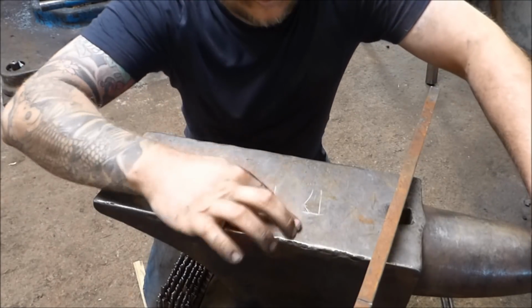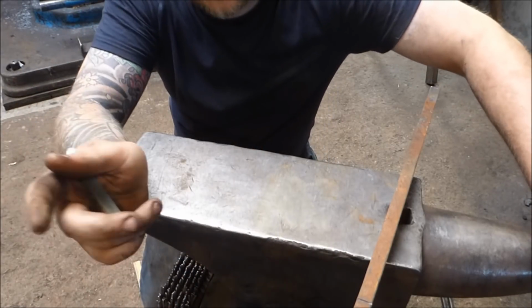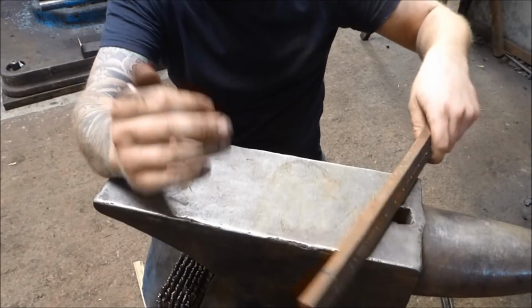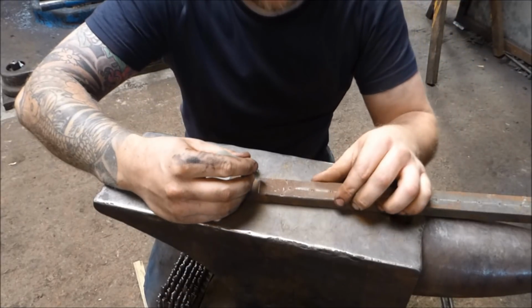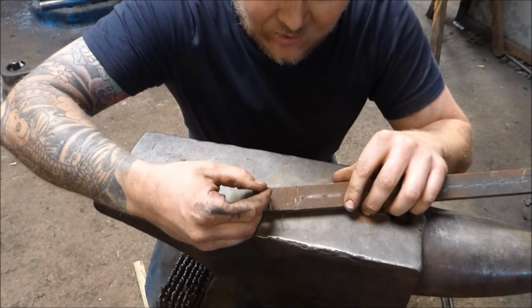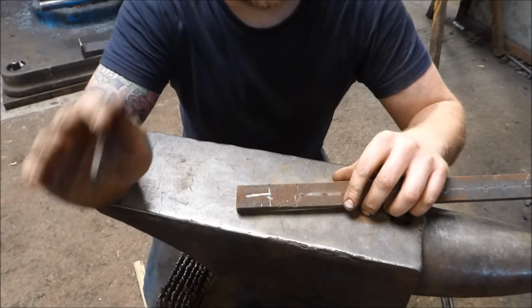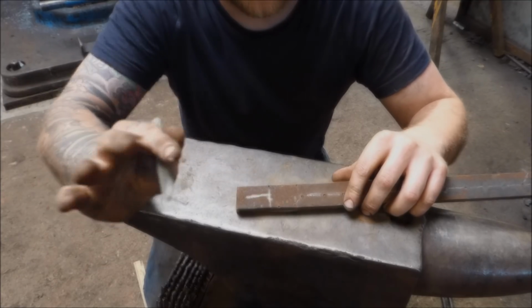Now, for everything artistic wise, it's not a problem, but for tongs, where the nib would be, you are putting just behind the nib a shut. And that is where they break. They're going to break there. That's why I don't like these.